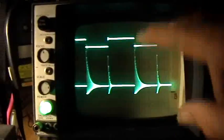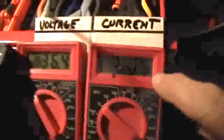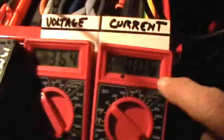But you see there's not a lot of real switching going on. And this high voltage spike is a result of the inductance. And you can't do anything with it because it's just the same energy bouncing back and forth in the circuit. Bounce, bounce, bounce. Until it's finally dissipated as heat in resistance. That's why it has this shape. Okay, and then there's not very much DC current going, right?